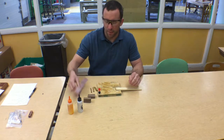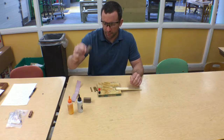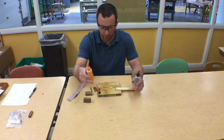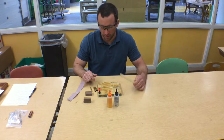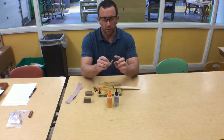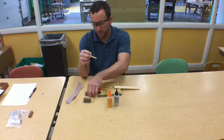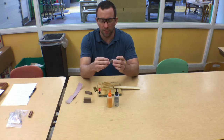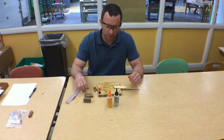To do this we need sandpaper, our tubes, our blanks, and a two-part epoxy. The two-part epoxy gets mixed 50-50. We have a board to mix the epoxy on and a stick to mix it. Take and roll the bottom end of the tube into the epoxy, then slide that bottom end into the blank. Allow it to dry — I believe it says 12 hours on the epoxy.